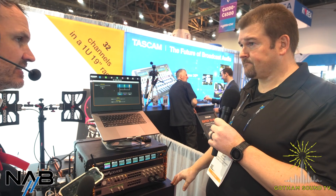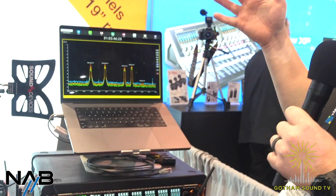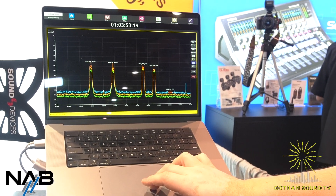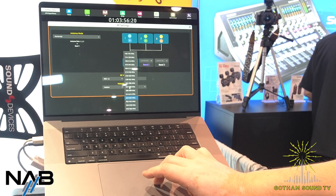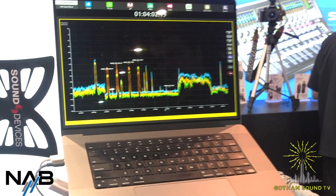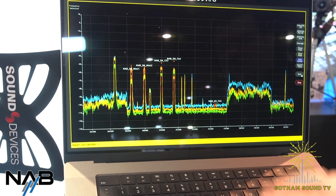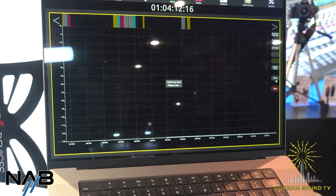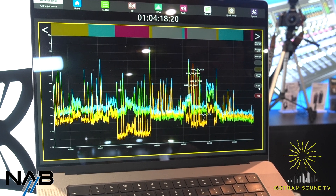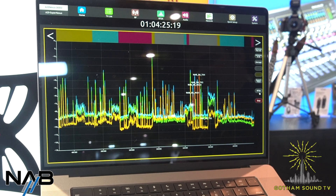How is the RF at NAB this year? The RF at NAB is pretty congested, so I can take you into the real-time spectrum analyzer. We've selected duplex gap here, which is 653 to 663, because no one was using that. But I could go back to my RF menu and pick something in the UHF TV range, and you can see how congested this is with digital television and other things. There are many, many wireless transmitters on this show floor and lots of digital television.